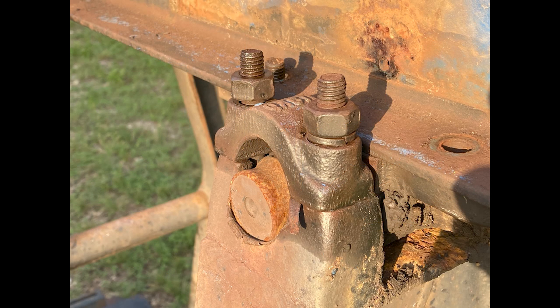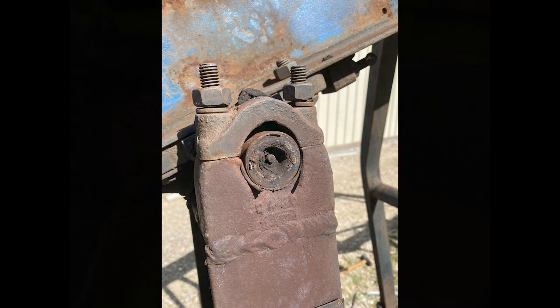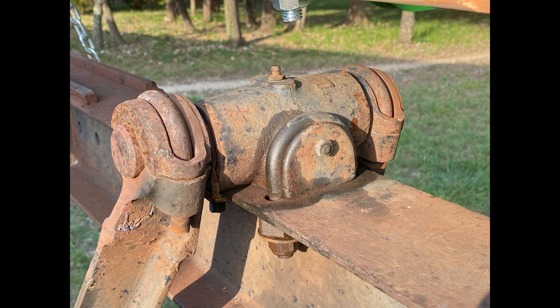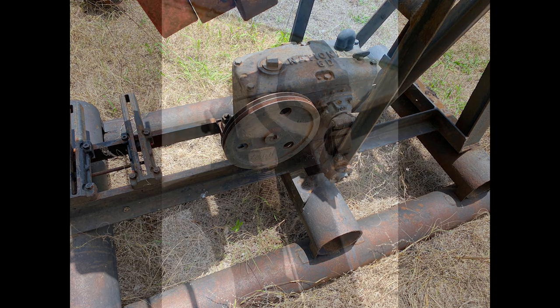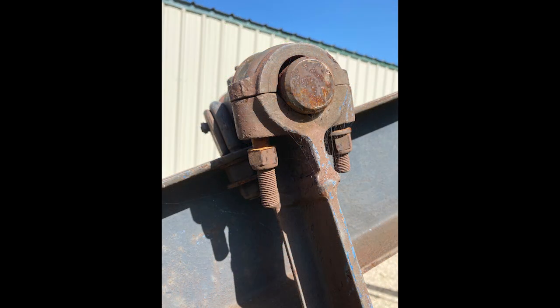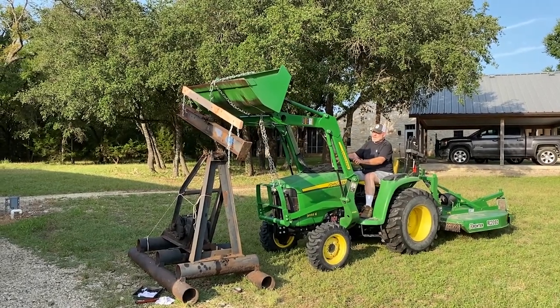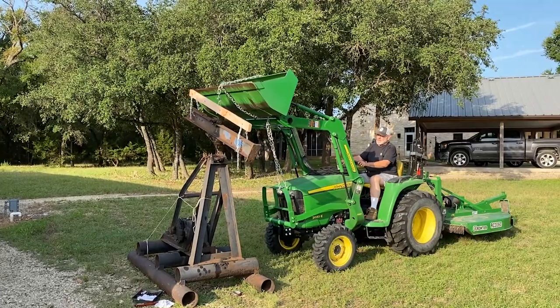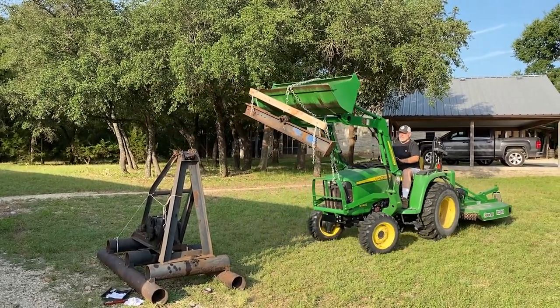After getting it unloaded, I carefully went over the unit and discovered the bearings were completely shot and would have to be repaired or remanufactured. The gearbox was, however, in perfect shape, and it could be easily turned by hand. The pitman arm bearing was totally worn out, and the main saddle bearing was even worse. After lifting the walking beam off the Sampson post, I discovered the damage was much greater than I thought.